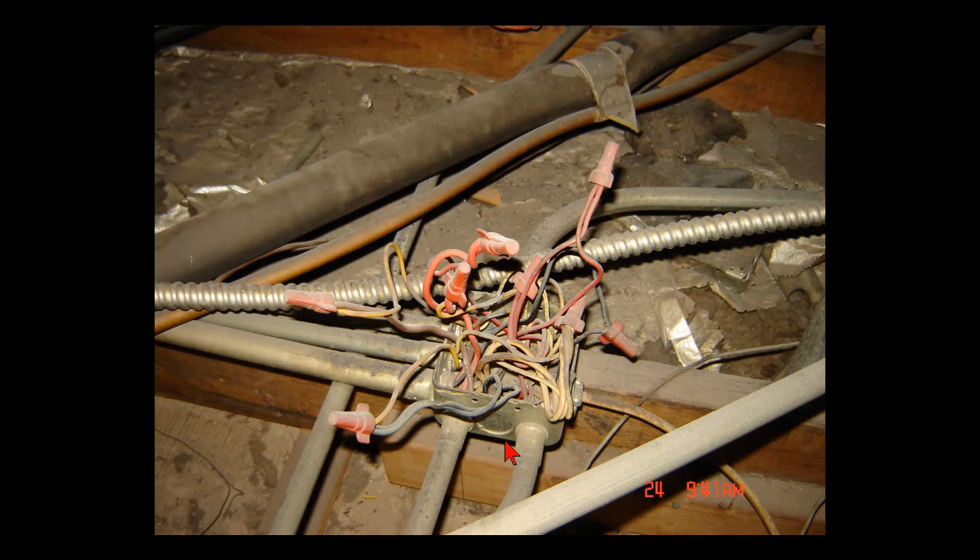You can see there's one, two, three, four, five, six conduits coming into it. That's the home run right there, and you've got this little Romex jumper. The funny thing about that Romex jumper is it's actually being fed from another panel — so this would be panel A and this is being fed from panel B into this lighting.